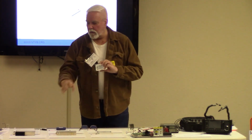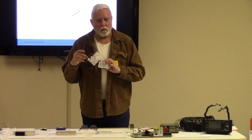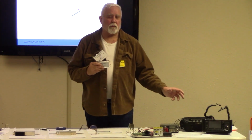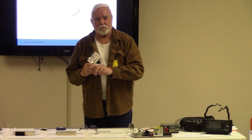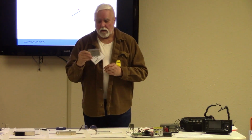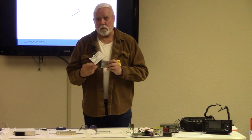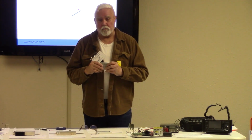You don't need it if you're in these low frequencies. Where you need it is where you're going to try to run 24 gigahertz, because you would prefer not to start with low frequencies and then multiply them 12 times. You want to start with something that's much closer and very good and stable, and this is the thing that will do that. So this will give you a frequency that only has to be doubled to get to 24 gig, mix with 144 megahertz.